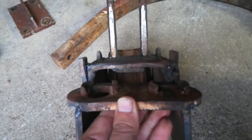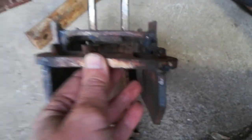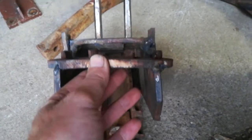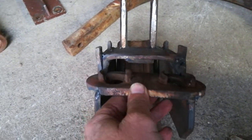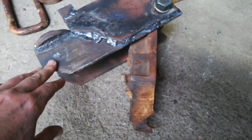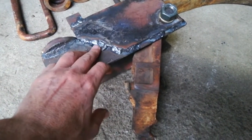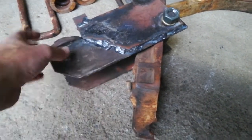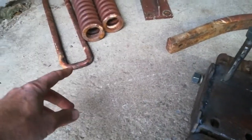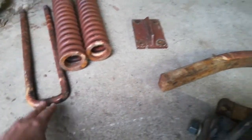So I ended up cutting the side plates off, getting it hot, bending it back, re-welding it, testing it, and getting it fitted — it's a snug fit in certain parts. Then I welded it all back together. The welds aren't beautiful, there's a little bit of undercutting, but I overdid it and there's plenty of overlap in the plates. Good farm welding — that's what I'll call it.